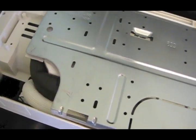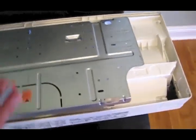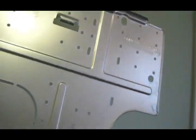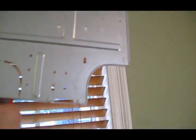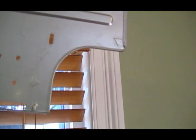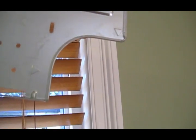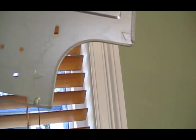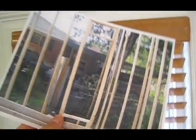What we're going to do now is take this bracket, reverse it around, put it up on the wall, drill our holes corresponding with the bracket positions, and a three-inch hole to pass the tubing. We're going to take some PVC pipe, sleeve it, and go outside with it. I'm going to take a nail and a hammer and manually find the edge of those studs — I could use a stud finder, but a small hole in the wall won't make a difference since it'll be covered.